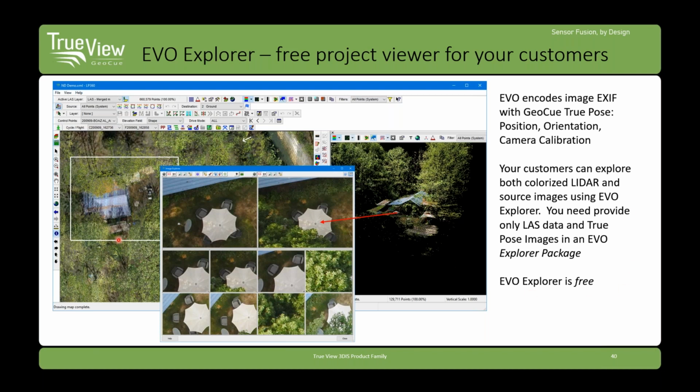But they can also click anywhere in the 3D point cloud, and it will bring up the images that see that particular point. So here we've clicked on a point in the point cloud, and it brings up the photographs that are seeing that particular object space, and we see there's an umbrella here. So this is really great for construction inspection. So I've got, say, a girder that I can see in the colorized LiDAR data, but I want to see if bolts have been placed in that girder or not, so I can bring up the photographs and have a look at that.